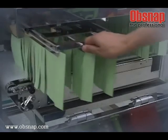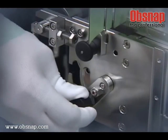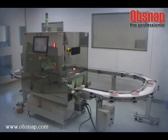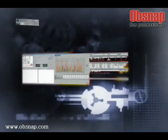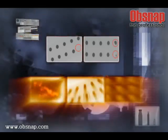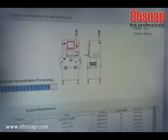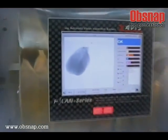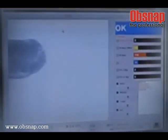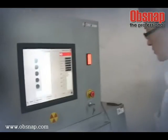All X-ray inspection systems from Java for foreign material in food are equipped with the following functions: automatic setting for inspection standard of new production models, equipment cleaning, production control by daily, monthly, and by model, MTBM and MTTR analysis and facility control, a month's automatic storage of image and output analysis, report output, system monitoring, monthly alarm information output, and automatic alarm in the event of abnormal occurrence in the process.